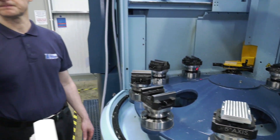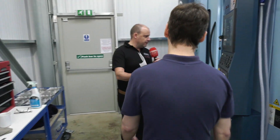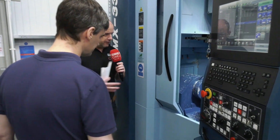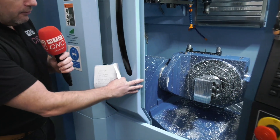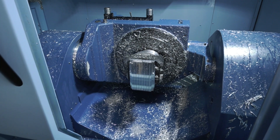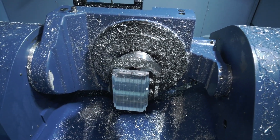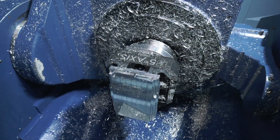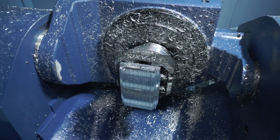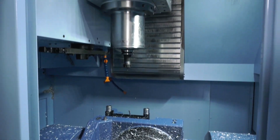You can also access here while the machine's in action as well, can't you? Absolutely, yes. Now you're machining aluminium here — is that the majority of your work? That's correct, most of the work on this machine is aluminium. And it's full five-axis — five-axis simultaneous is possible? That's correct. Most of the work we do is three-plus-two, but it will do simultaneous machining.